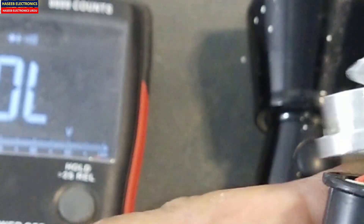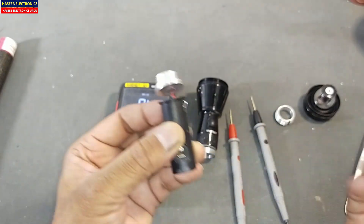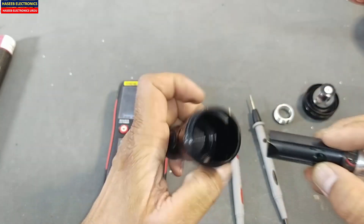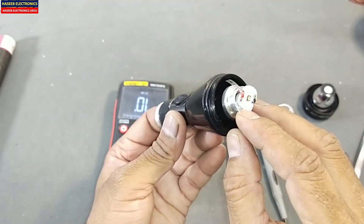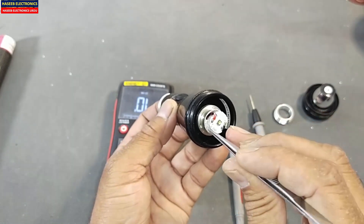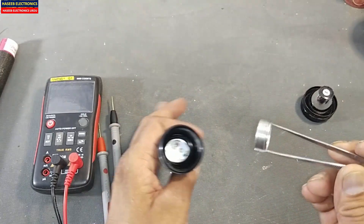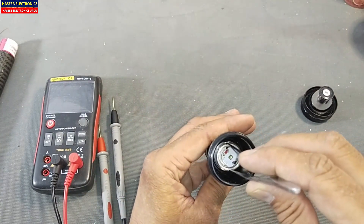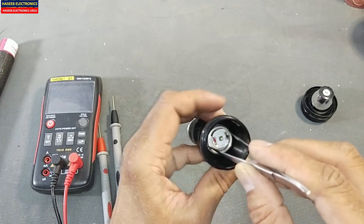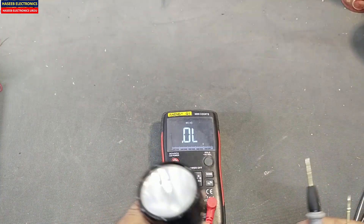Let's pack it up and check it — we can see it now has good space. Keep the switch upside towards the push button. Place it here, then hold the lock nut and place it carefully. Align its threads and rotate it clockwise. Align it properly and tighten it.